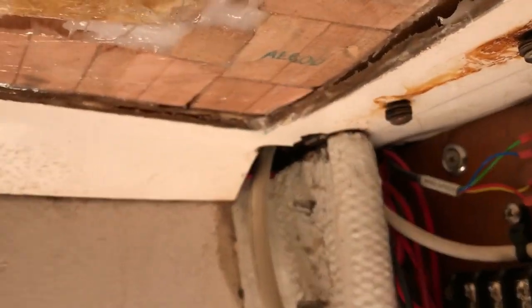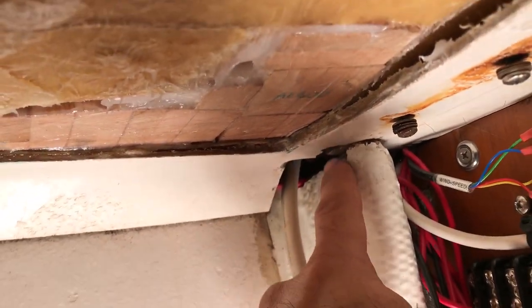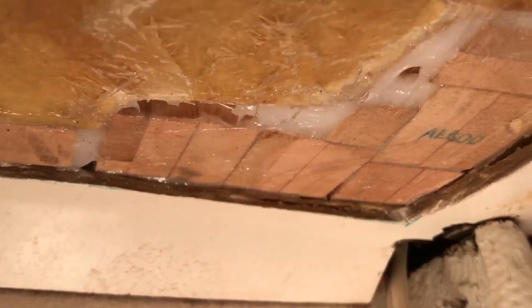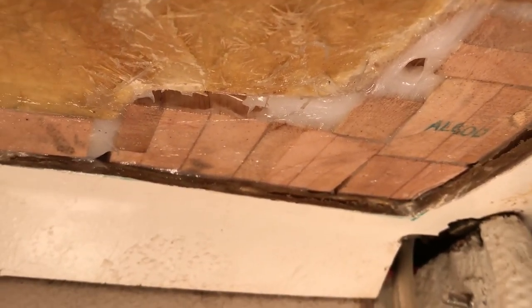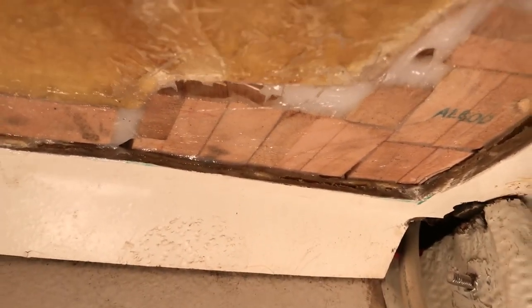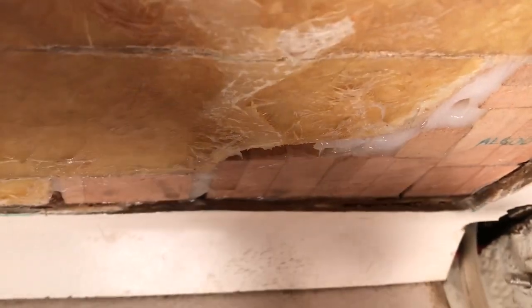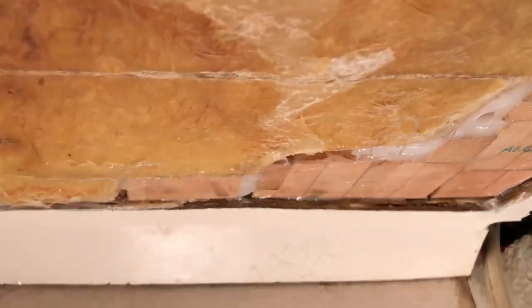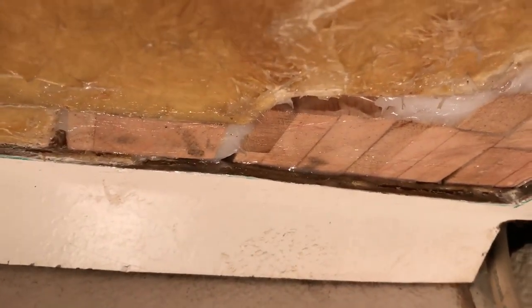Once I plug up the area there for the chain plate, the bottom opening, I will pour in some slightly thickened epoxy from the top, which will fill in a lot of the voids that are probably in this area here, and then drill it out from the top. I still do need to put in a bit more epoxy in here.